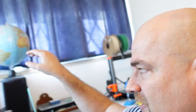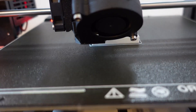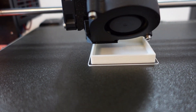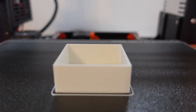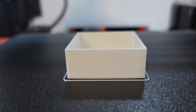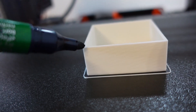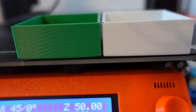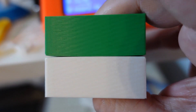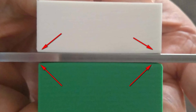With the same circumstances for PolyTERRA PLA, I cannot see any warping visually. But I will see when I take it off and compare side by side. It looks like it is very hard to force PLA to warp — it would be very different with ABS, for example. But yes, it looks like it's true that PolyTERRA has less warping compared to regular PLA, in this case PolyPlus.